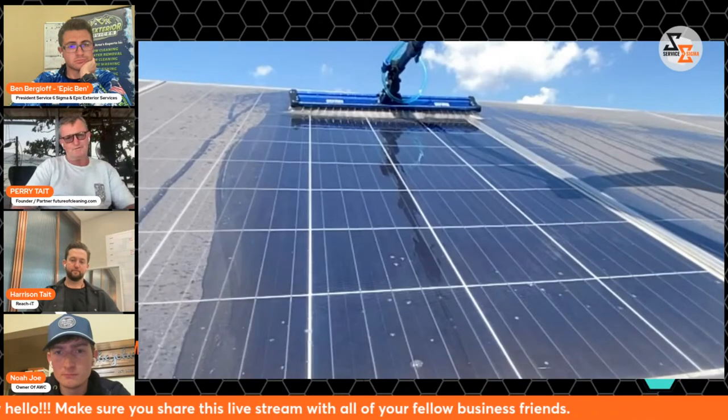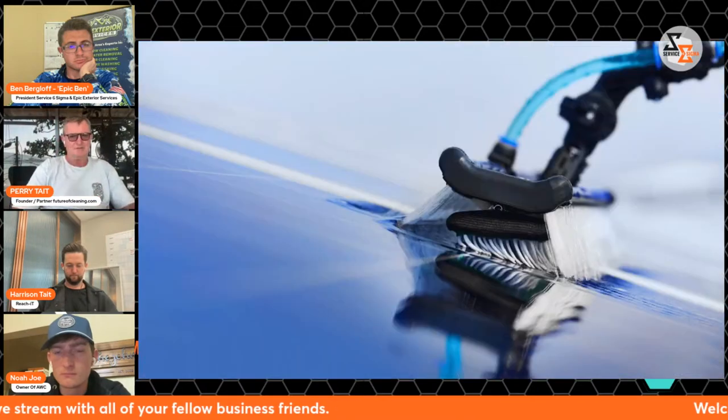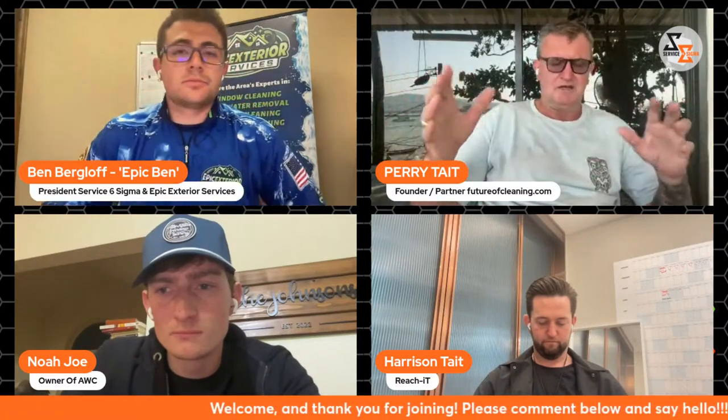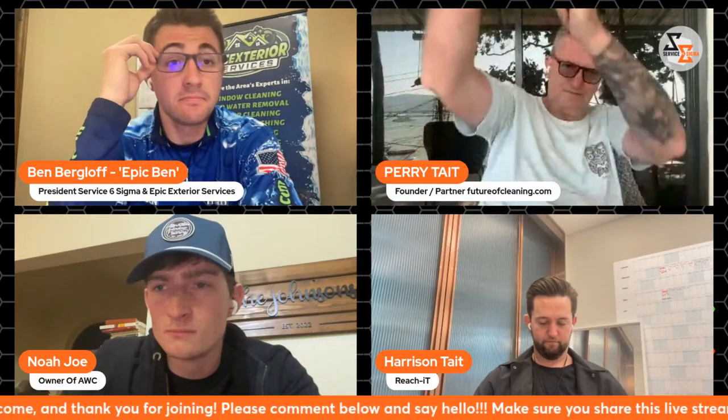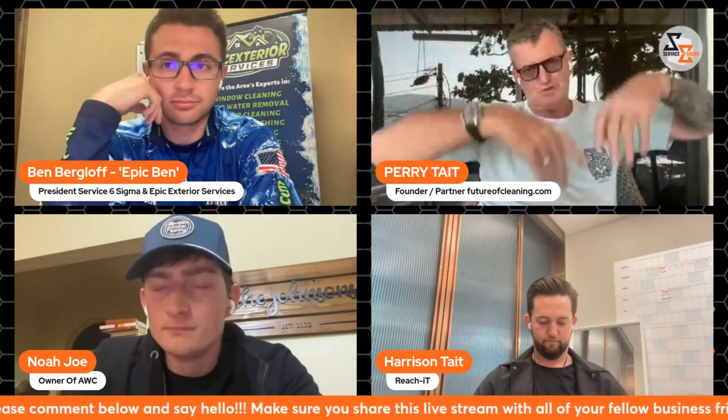But if you can do full length strokes, you're going to pull all the dirt off in a single stroke, and then you've got a good chance of efficiency. That's where the guys using a 22 inch panel brush on a 39 inch wide panel, full length of the panel in each stroke, do two actions on one side, two actions on the other side, then go to the next panel.